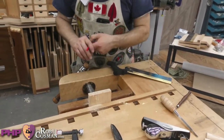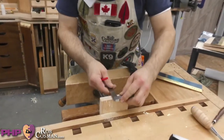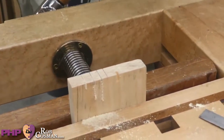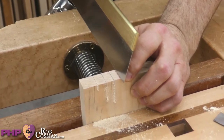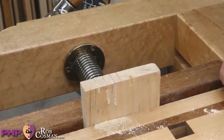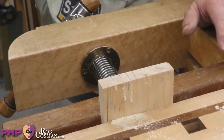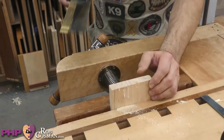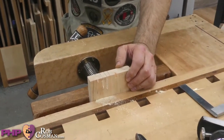When you're getting ready to cut a dovetail, and you've got your line, if your saw cut is anywhere but where you want it to be in relation to that line, then it's in the wrong spot and it has to be fixed. If it has to be fixed, it has to be done with a chisel. Very difficult to do. You're opposing the grain, just going to be rough. So you need to have 100% control over where that saw starts cutting.